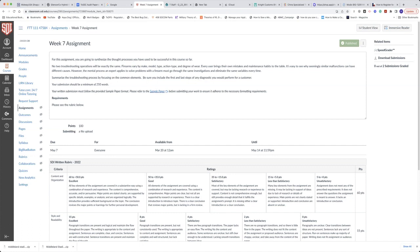You can also use the Scotch-Brite green or brown scouring pads. I use those a lot to polish the inside of shotgun barrels. Again, you're not taking off much, but it's abrasive enough to take out any of the scratches or that kind of stuff.